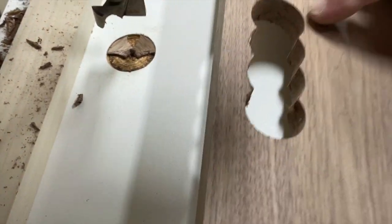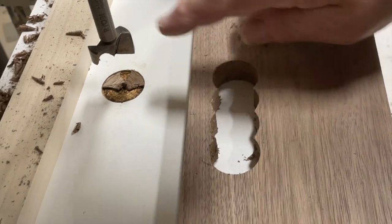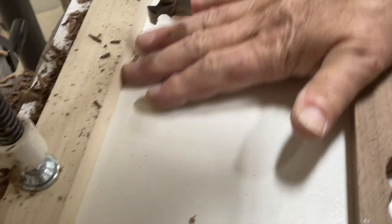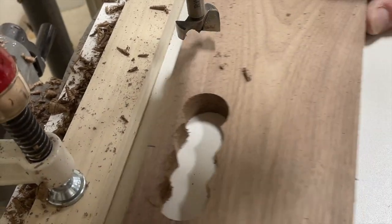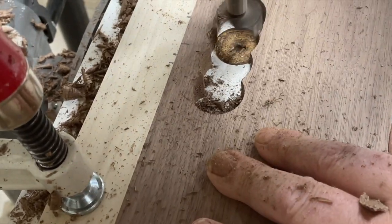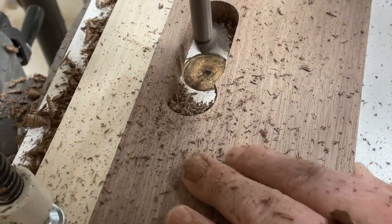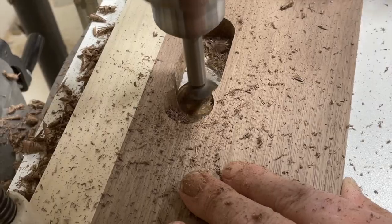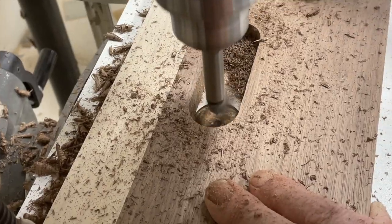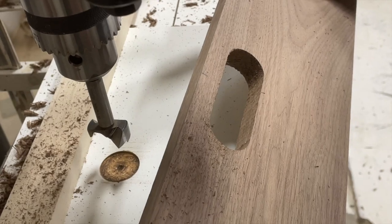You can see that I've drilled my four holes, but there are points sticking up. I'm going to go through with the drill press, move along, and nibble off those points to straighten it up the best I can while on the drill press. Then we'll take it over to the bench and finish it off. There's the start of our hole — let's go back to the bench.